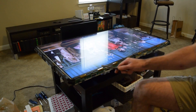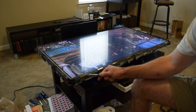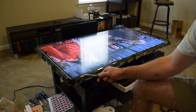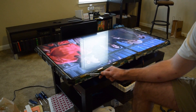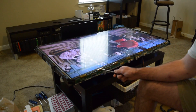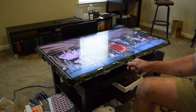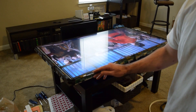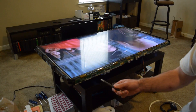As you can see, when I tap it I can get the problem to come in and out simply by wiggling and messing around with this right here. None of the other cables cause this — I can wiggle those all I want and they're all pretty sturdy. The problem is on the right-hand portion of the screen, which indicates this cable right here.